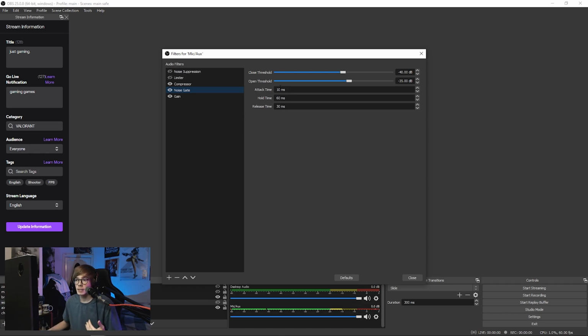The attack time is how quickly it responds. In my case, I want this very quick. I don't want any noises to be heard. I don't want any alarms slipping through or any shenanigans happening. So this is dependent on you. For this, I have this at 10 milliseconds.